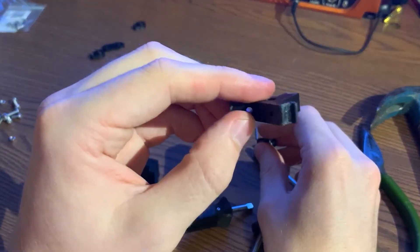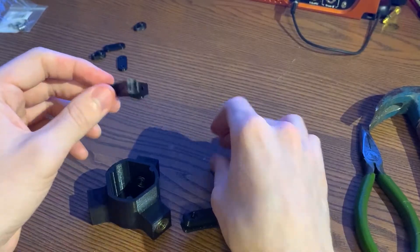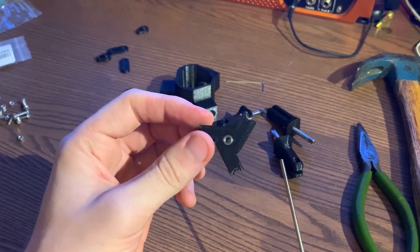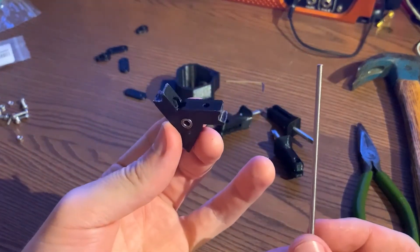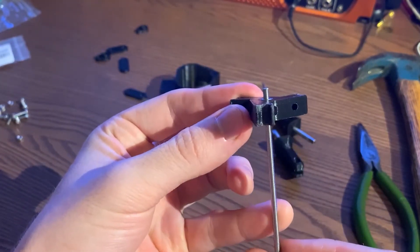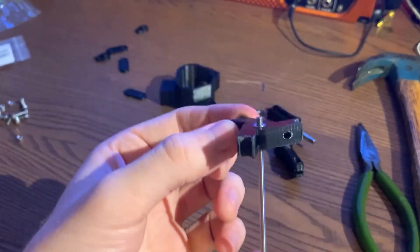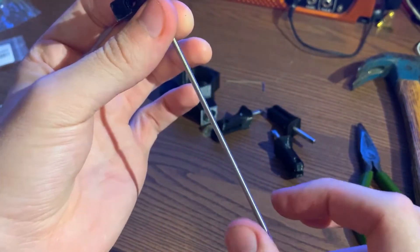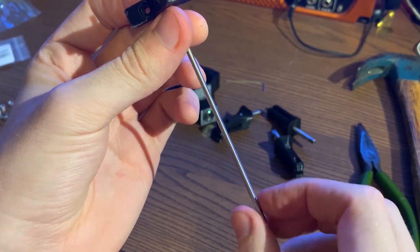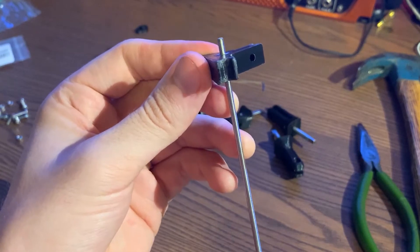This all happens on this — it slides down inside here and then we have a pitching blade set. I haven't exactly figured out what actuator I'm going to use inside the actual aircraft body, but basically I'll have this threaded three millimeter rod that runs through these plates. This will be secured with a nut and some washers on either side, and that pins it but this is free to rotate. I can move it up and down — I'm thinking maybe having some sort of fixed nut in the fixed frame, so as this entire thing rotates I would push it up or down with respect to the airframe, and that gives you really fine control of the collective setting.